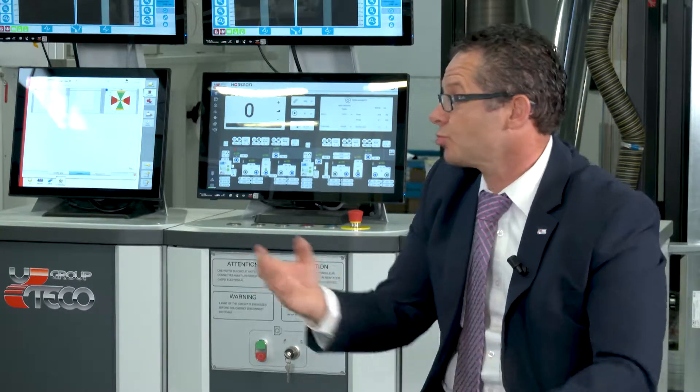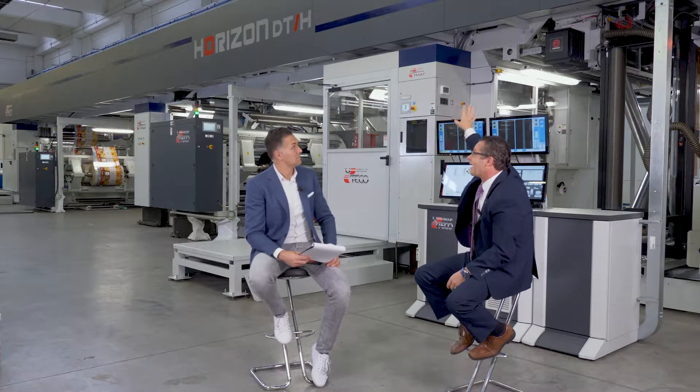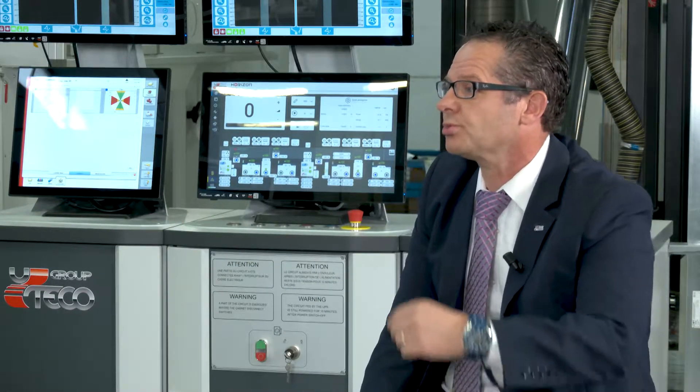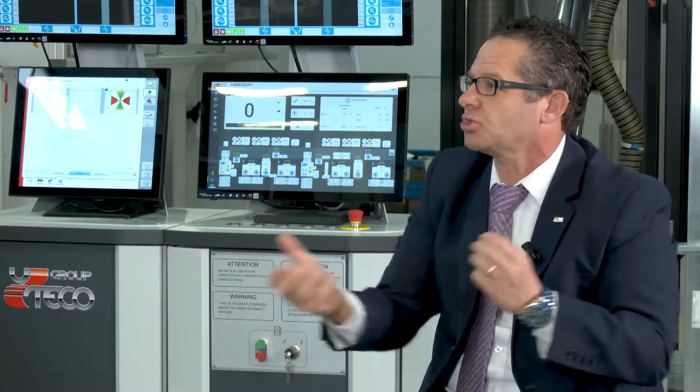The dryers are also equipped with driven idle rollers by AC vector motors to ensure web stability for low-density polyethylenes and polypropylenes. We also have burners for temperature control. Fan recirculation is accessible from the catwalk, so it's easy to get around the machine. It's also easier for threading up the material, and we have easy cleaning of the rollers by extracting the blowers — all nozzles are extractable.